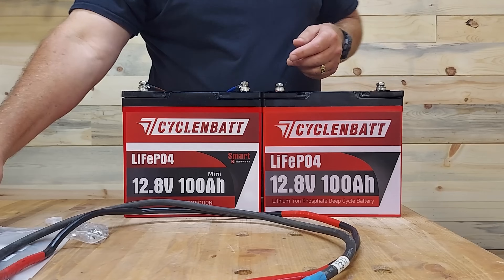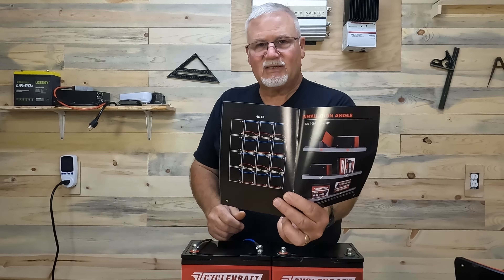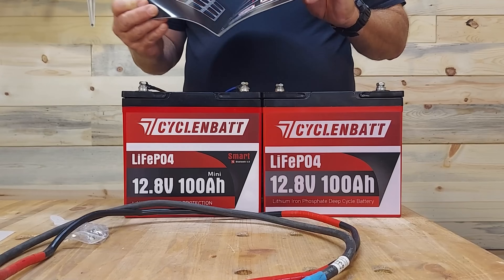The real question is: is that a good or bad idea? I see online all the time people being told don't put your batteries in series. I think many years ago, when LiFePO4 or lithium-ion batteries came out without battery management systems, the people saying that were mostly correct. But with modern LiFePO4 batteries of any reasonable quality, they already have built-in battery management systems. And the manufacturer will tell you exactly how to connect your batteries in series or parallel configuration. The fact that the battery manufacturer says you can do this should be the first indicator that yes, you can.